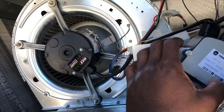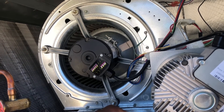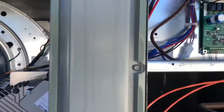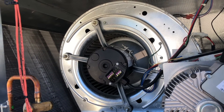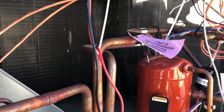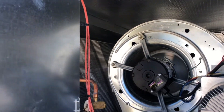Something interesting here — this blower motor, even though it says 'motor,' Trane actually considers it a control module for the motor. I'd never seen one before and even Trane tech support hadn't seen it either, but after research, this is what they use as the control module, and it sends a signal to the board. You just heard it click. Now look — the jumper has been removed, there's no call for cooling or heat, the building is satisfied, and yet that fan is running because the jumper is gone. That's how it comes from the factory.